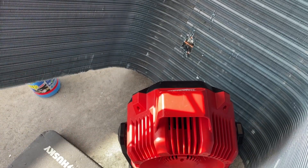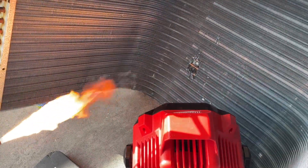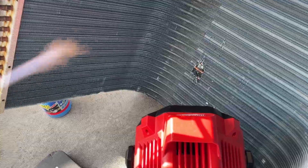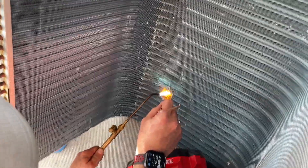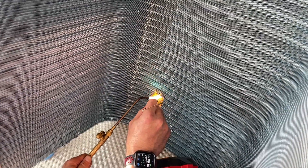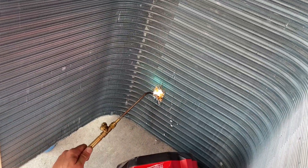I've got this fan going just because I don't want to breathe in and vaporize the refrigerant — it would seem like a healthy choice. These are tricky because the copper is so thin. I'm going to lay a little braze on there as a heat indicator. Even though under normal circumstances you kind of want the pipe to melt the braze, in this case it's better to lay the braze on the pipe. That way you're adding just enough heat, and you can tell when it's hot enough by the way it flows. It's a better technique for brazing this really thin, cheap copper.